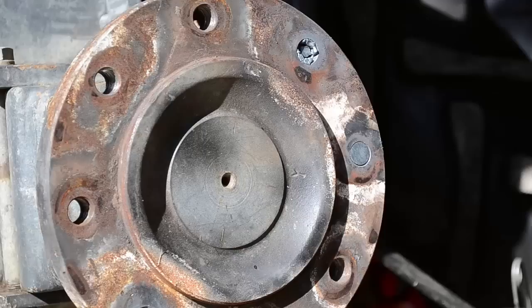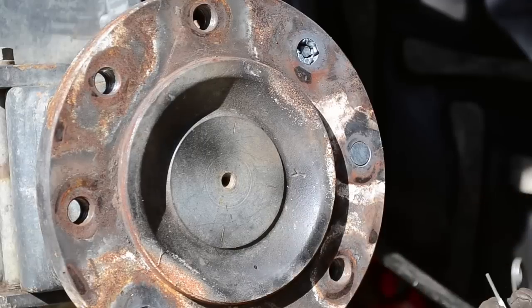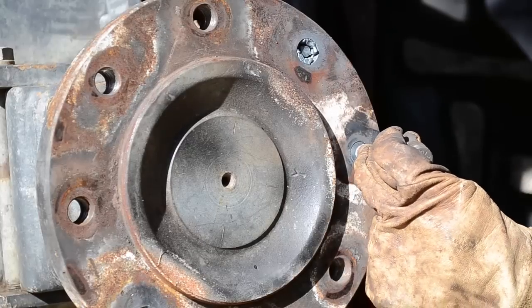Right now, I think I'm running around 85 amps. This is a 3/32 rod. So good hot burn in, that's what you're wanting. 6011's real good at tacking. That's what they're great at. So fit this one up real quick. Give it a few quick tacks.